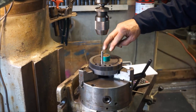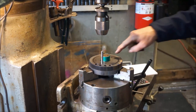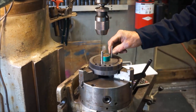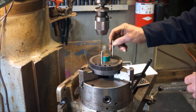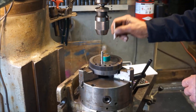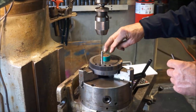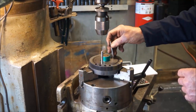We're going to go ahead and go over here, and we're going to come over and locate one. We're going to look at our readout, and we're going to locate that, and then we're going to come over and take a look at that one there. Before we actually drill any, we want to see if coming over and locating with a quarter inch pin, which I believe that's 5/16, I'm going to check on the thread diameter, and 257 is our drill size for the 5/16 tap there, and we'll go ahead and drill and tap those two holes, but I want to see if they actually are split off from center and exactly in line, and then we can go ahead and drill them accordingly.